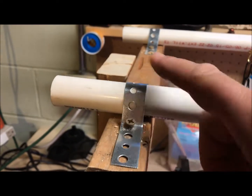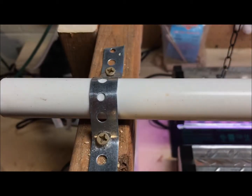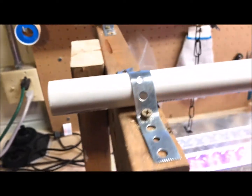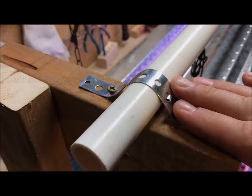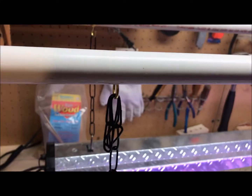Use the plumbing straps to attach the conduits to the two by four. It's really simple — you need some tin snips, snip a piece about six inches long, drill it, screw it down, and it's stable. This thing is not going anywhere, which I love. Get the PVC and eye hooks down in hardware, and you're in business.